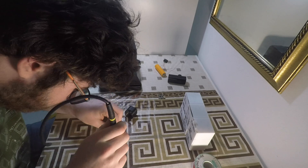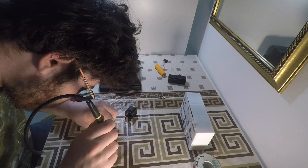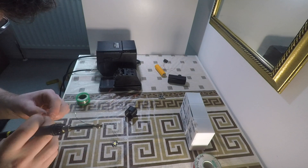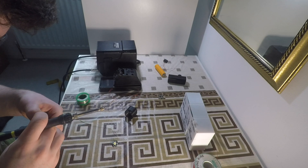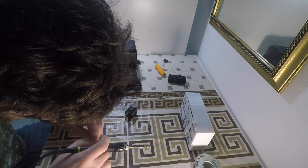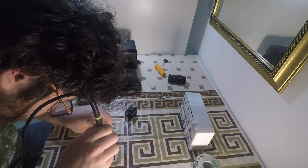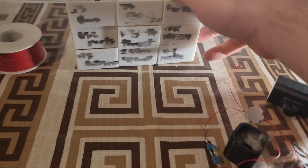After I had a power supply sorted, I needed to work on some circuitry for the LED. I first soldered two pieces of wrapping wire to the LED backing plate. In order to control the power to the LED, I needed a 4 ohm resistor, but I didn't have one powerful enough. So I soldered four in a two series, two parallel configuration in order to reduce the current going to each resistor and thereby reduce the heat.